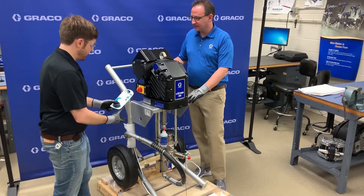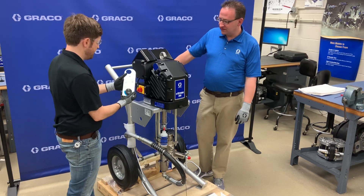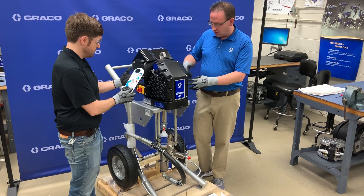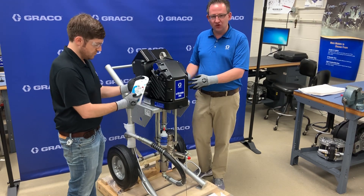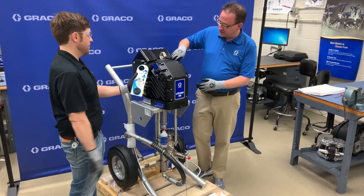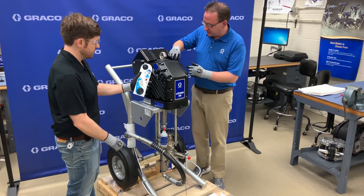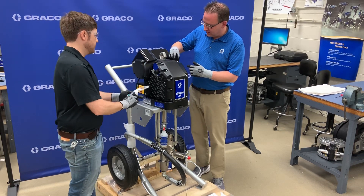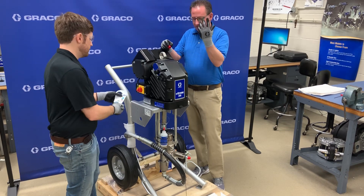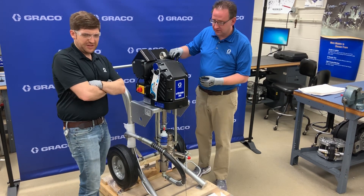There was one other thing on the setup — it came with this extra little knob. It's not necessarily a knob — it's a filler breather. When we ship these drivers they have oil in them, a special gearbox lube specifically for these drivers. You need to take the red plug out — right there — and replace it with the breather, so that as things heat up and cool down it can suck in air and breathe like it's supposed to.